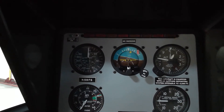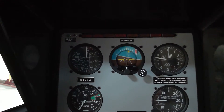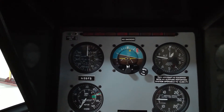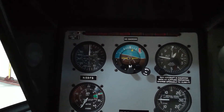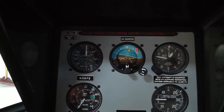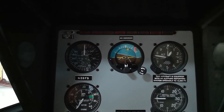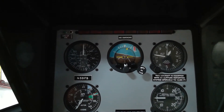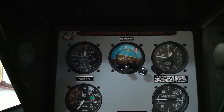Robinsons also have an alarm that goes off to indicate low rotor RPM. Some older aircraft do not have an alarm — it is up to the pilot to recognize characteristics of low RPM, which could be possibly abnormal vibrations or a retreating blade stall, as we talked about in the retreating blade stall video.